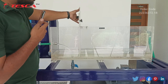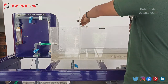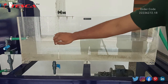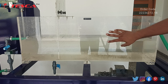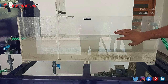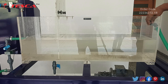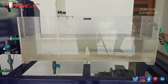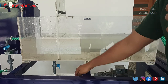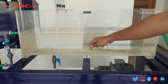Let's turn it a little bit down and screw it back. As you can see, the slurry is coming into this tank. Through this lid, all the clear water will come into this sedimentation tank, where the sedimentation process will take place. All the heavy particles or dirty particles will settle down in this tank. The clean water will come out through this overflow — this is the outlet pipe of the overflow, and you can collect the product from this pipe. To take the slurry back into the slurry tank, open this valve and all the slurry will drain into the slurry tank.